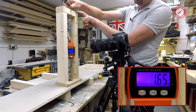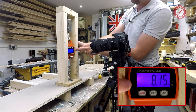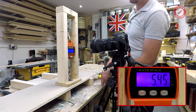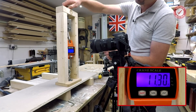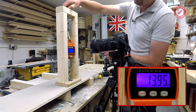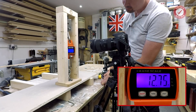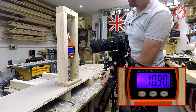These fittings really aren't designed for anything heavy duty at all, but they're fine for things like pictures, mirrors — stuff like that, as long as they're not too heavy. Bear in mind we're going on an axial force here; a shear force is going to handle a much higher load going down through the plasterboard as opposed to being pulled straight out. I've just finger-tightened it — we're already up to five kilos. Let's see if we can get to 10. I'm on 10 and it's just literally finger-tightened. Is it going to fail without even using the spanner?